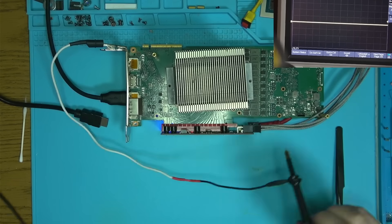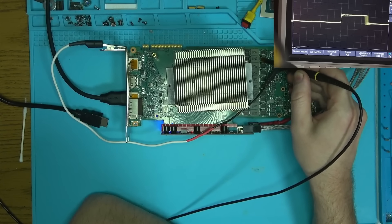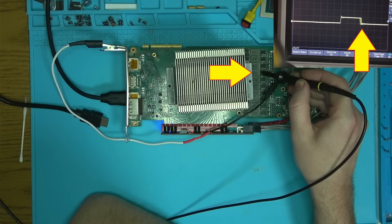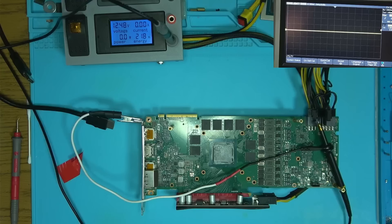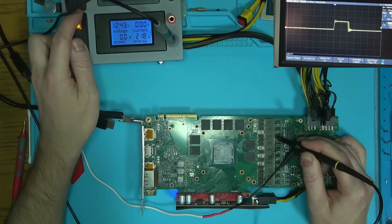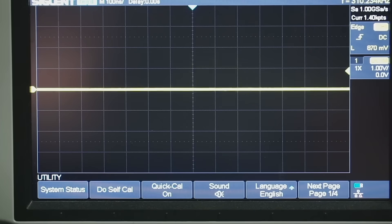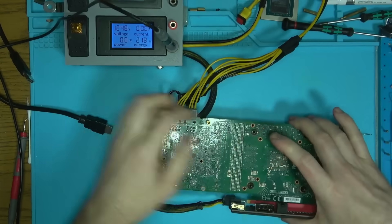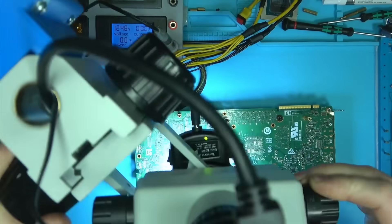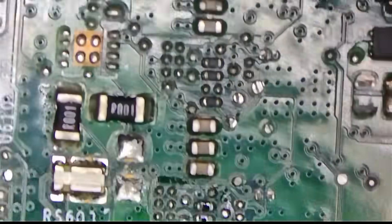Okay, we have a pass, and while the card is running, I'll go ahead and check all power stages to make sure all of them work correctly. It looks like two are a bit long. After testing again, it looked about the same but ever so slightly longer, almost hard to see. My best guess is something is still missing on the back of the board affecting the feedback circuit, and we just need to find it.